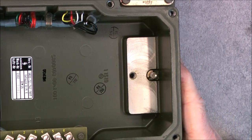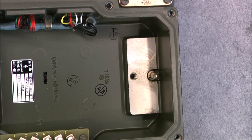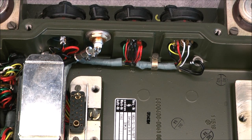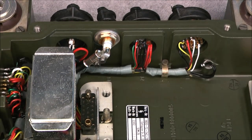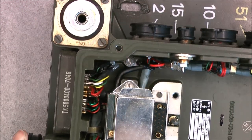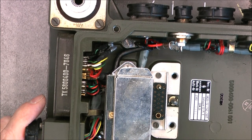About what we have in the base module — you can see how thick and sturdy it is, with a guide pin to the power supply unit and the wiring secured to it very well. Double metal clamp here to the shielding of the coax, thick wires on the power supply input obviously, and a lot of wires going to this main connector.